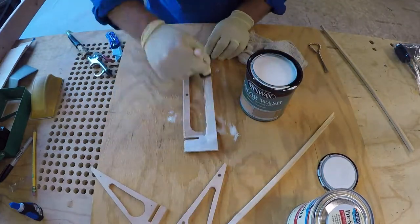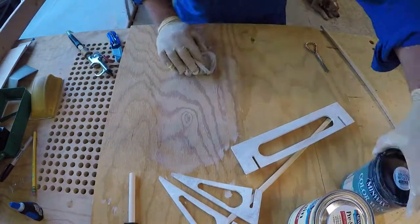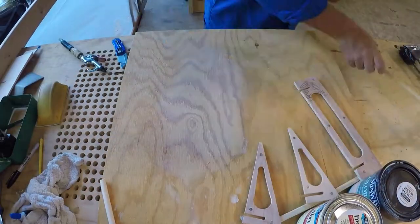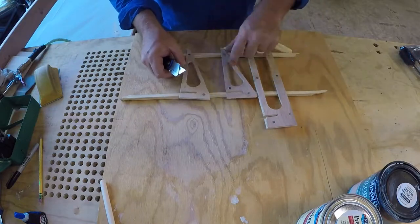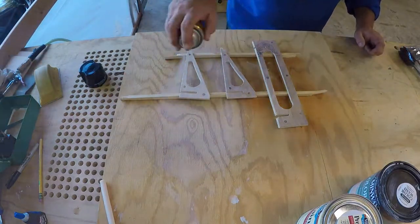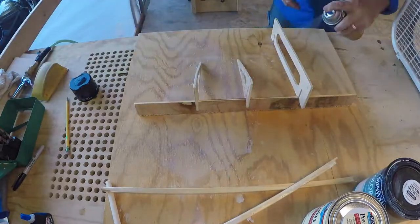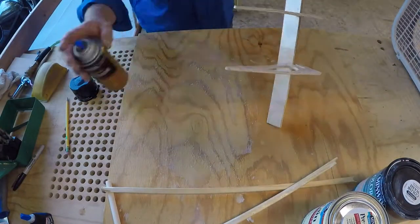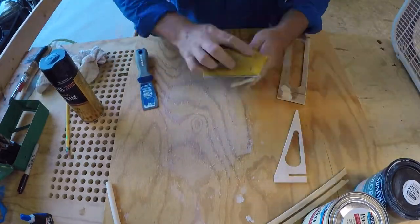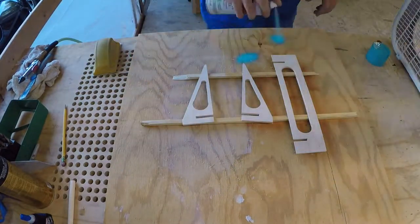This is a white stain — I left my logo on this one and I think it's going to look really cool. Now that it's all stained up, I'm going to put some polyurethane on it. Make sure you give the polyurethane a good shake — any spray paint, shake for one solid minute. As I come across the piece I'm about 8 inches above, always going over top and never stopping on the piece. Now my wife wanted a cool one with her favorite color, so I'm going to take off the double-sided tape, give it a quick sand, skip the magnets on this one, and just paint it — it's going to be like a fixture piece on her desk.